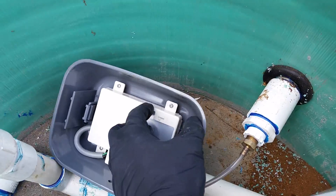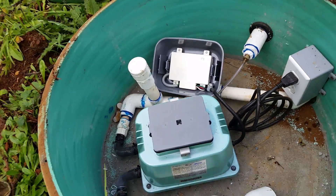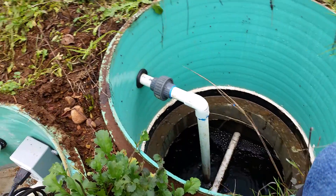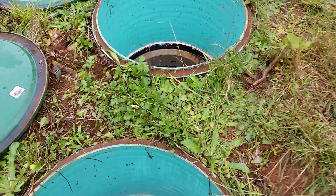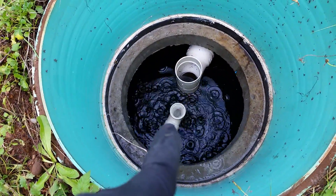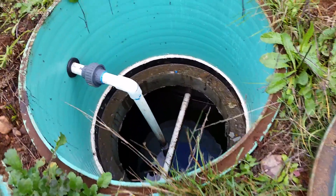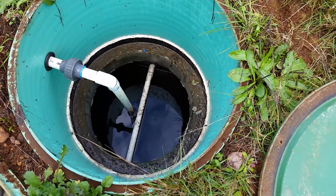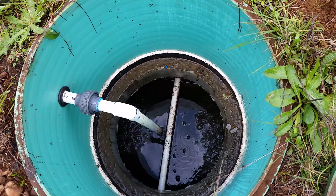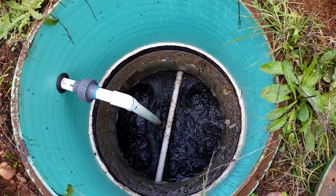Then, once you clean the air filter, the blower takes all the solids off the floor through this little white tube and brings them back over here — that's where the solids are going, back into the trash tank and out of the ATU. Then at 3:30 in the morning the blower kicks back into its traditional route and we feed the ATU again. This has also reduced our nitrogen in our wastewater, so it's part of our nitrogen reduction as well.